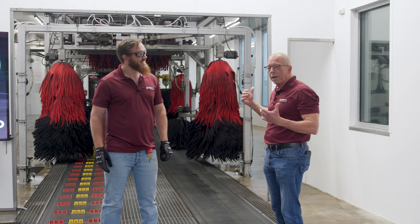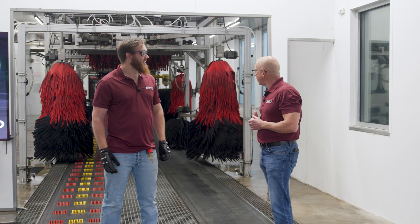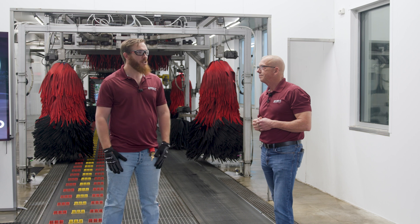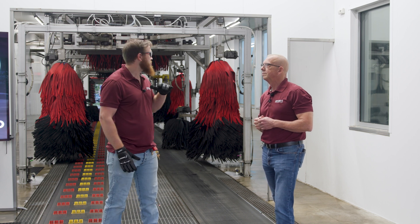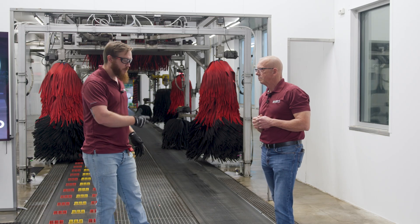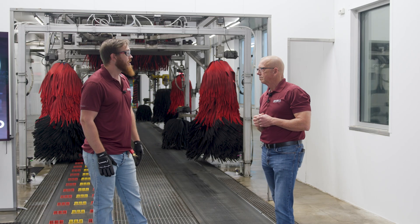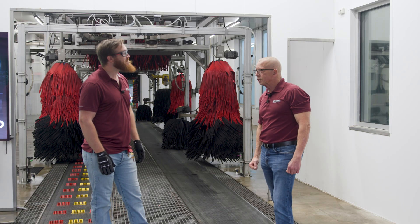Tyler, it's Sargent Clean. We've got about a 130-foot flat belt conveyor that we need to tear apart and get cleaned out. What's the first step? So first thing we're going to do, we're going to lock out and tag out our conveyor as well as our main, just so nothing starts while we're working in here. And then we're going to go around and strip all of the perimeter grating and all of this center grating so we've got access to everything. And then we're going to start cleaning down at the exit end.